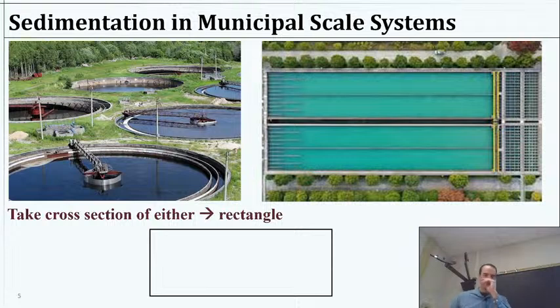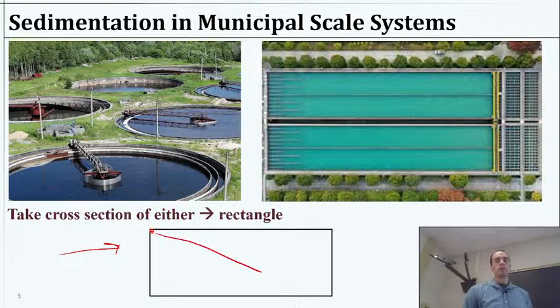Okay, so in commercial scale systems, and I suppose we could try to do something in a smaller scale continuous flow manner, so it could be applicable for maybe not point of use but decentralized, small scale systems, maybe something to clean up the water a little before people store it or take from something. Maybe some sort of a retention pond. Essentially, if we have water flowing through and we have particles, we want them to be able to settle to the bottom of whatever chamber we have before they exit.